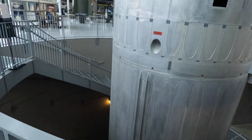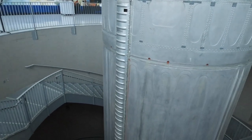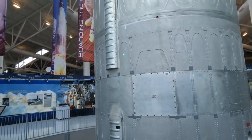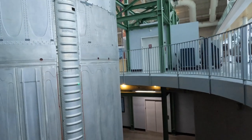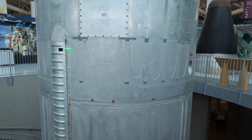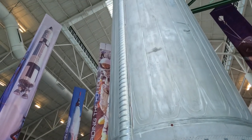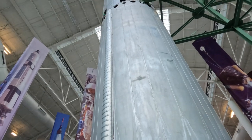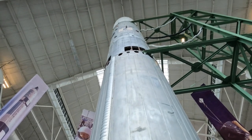The skins are the outer surface. There is stuff inside the tanks - there are pipes with other piping going to it for the electronics and control. This section here is where all the wiring is. These things open up - you see that hinge line - so this opens up like a door and then it would screw on the other side. All the wiring goes from one thing to the other - this is like the umbilical of the rocket. Your flight controls and everything are going to be in a ring way up there. The payload is this white section - in this case it looks like a commercial satellite.